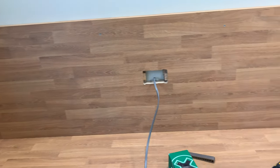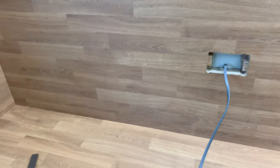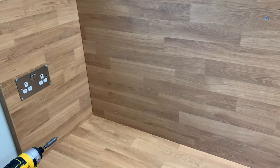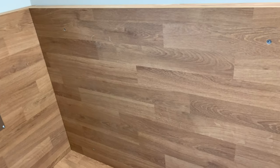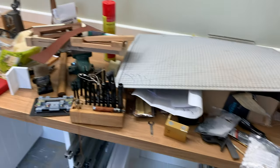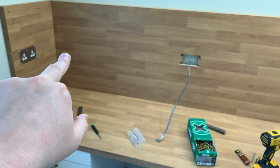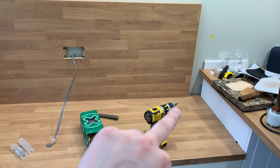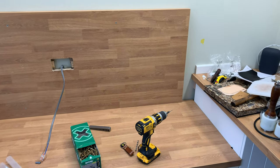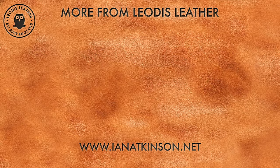There's the back piece in, which you've just seen me do. I've basically already marked where the studs were, which was what I was doing with the laser. I've got six big screws - I realise these weren't even big enough - I've got some 80mm screws straight through the top, straight through the plasterboard, straight into the studs. Six of those should be plenty strong enough to hold this. I'm pleased with that. I've kind of recreated what I had in my old workshop, except that used to be at that side. Obviously now I've got all this extra bench once I get all the rubbish cleared off it. The reason there's a little gap there is that is a standard length of worktop - I think they do something like 186 and 240. There was no point getting the bigger piece of worktop just to cut off everything by an inch.